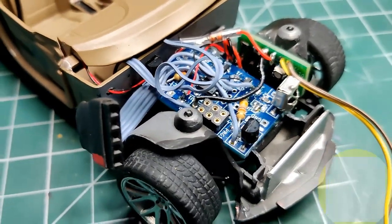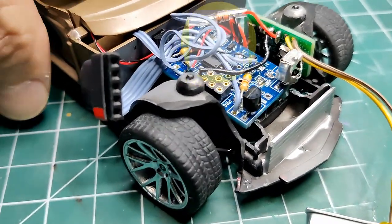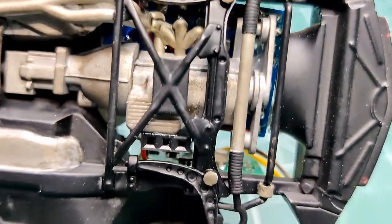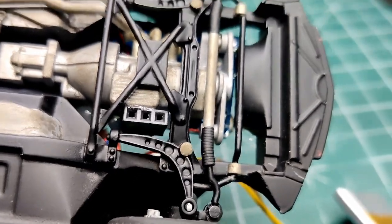Since this design was for a 3-volt power source, I used a diode to knock down the 4.2-volt battery supply to get it closer to 3 volts. I mounted a mating connector underneath for the 5-volt USB supply.